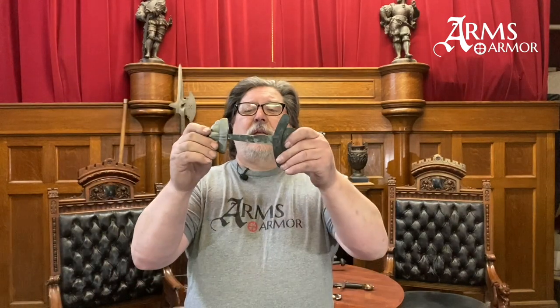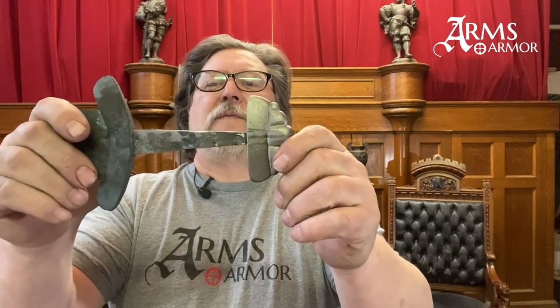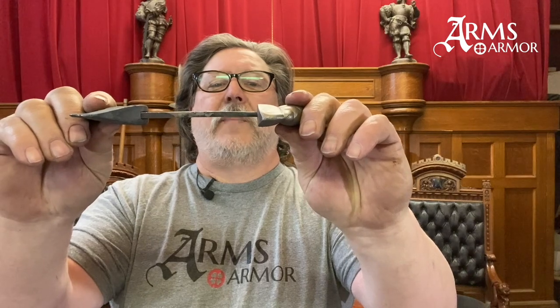In period, many hilt sections of the sword are iron. Iron is more ductile than steel — even low carbon steel is softer than hardened steel, but it's harder than iron. Iron is very ductile. It doesn't work-harden in the same way as a steel with carbon in it, because iron should have no carbon in it — that's what makes it iron. When we look at this tang, it's a reasonable tang that looks very similar to the types of tangs we see in pictures of originals, and this is all just a hand-forged piece of iron.